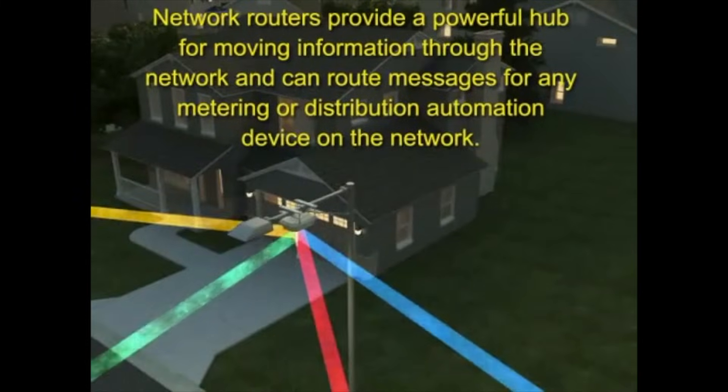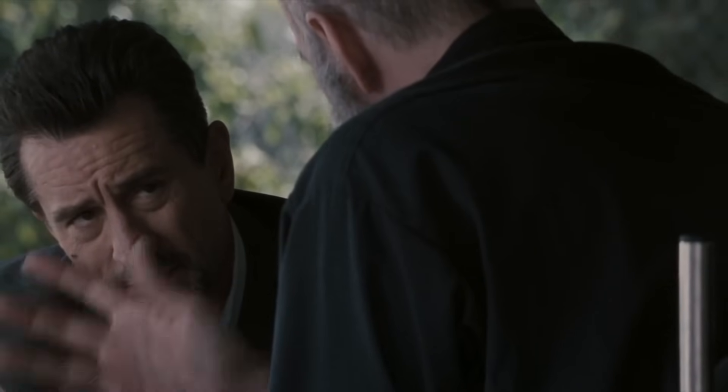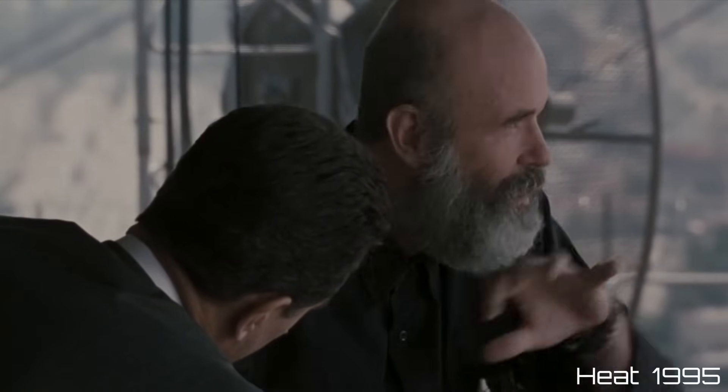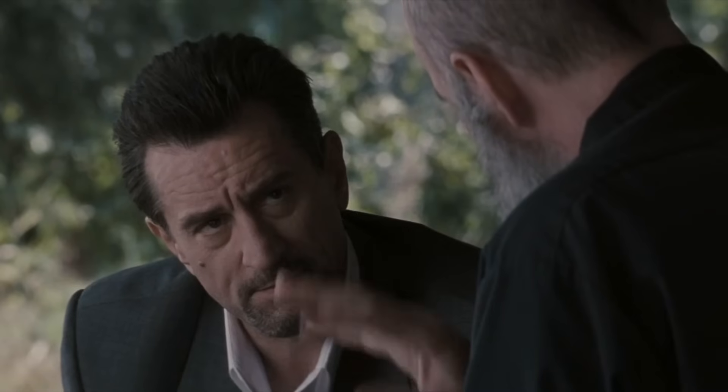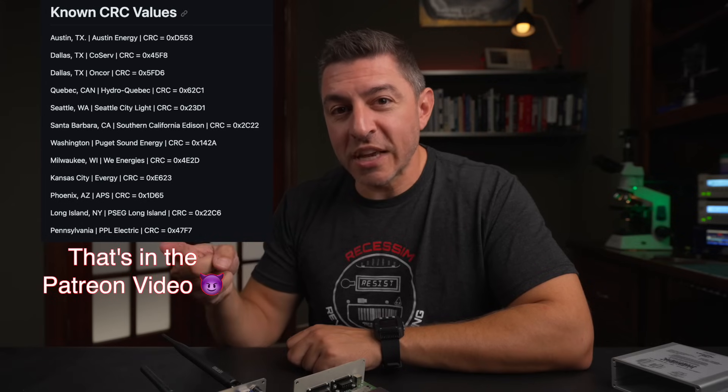Because it's routing this traffic across the network, anytime a new device is added — anytime a new meter is put on somebody's house — it becomes part of this network and routes the traffic. You would think high encryption, some crazy code must be entered to add a device to a network. You don't just type in a little four-digit code. Well, you'd be wrong. How do you get this information? It just comes to you — this stuff just flies through the air. They send this information out and it's just beamed out everywhere. All you have to do is know how to grab it. If you use the smart meters application that runs in GNU Radio and you receive packets from your Gridstream network, the CRC that's sent is actually related to the four-digit code. You run it through a different application and it spits out a new four-digit code from that CRC, which is what's entered into here.